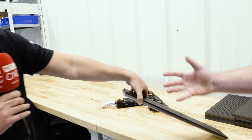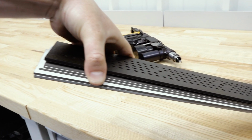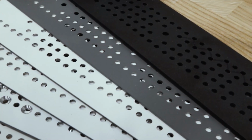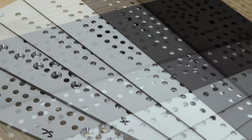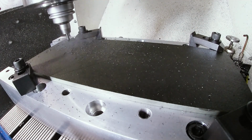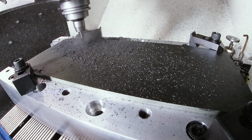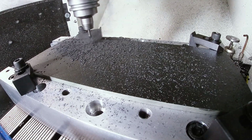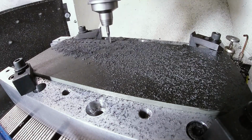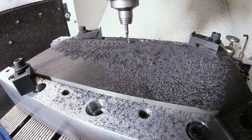Well, this is actually an example of a complex application for aerospace final assembly where they're putting components together and they're having to drill through the different layers to join the materials together with rivets or whatever fasteners they're going to use. In this example, we had to drill with one tool through CFRP, 4 separate layers of titanium and exiting in aluminum, all while still meeting the customer's requirements for bore diameter, interlaminar burr, exit burr, and surface finish. In my machining experience, that's a no thank you. I'm not sure if I can do that.